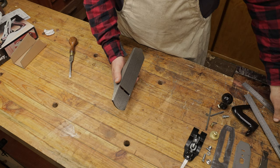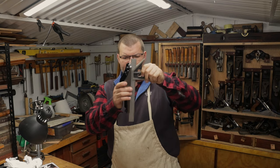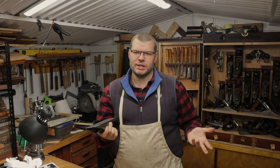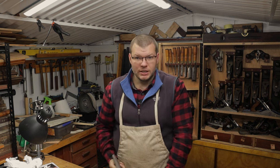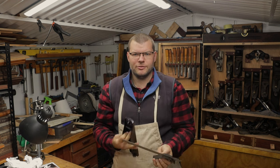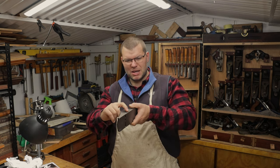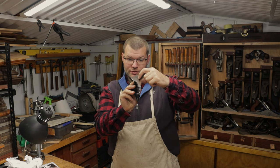I wanted to put a straight edge to the sole to see how flat it is. From what I can see, it's not out too much — at most maybe half a millimeter, which you could easily remove, and I've seen much worse on vintage planes over time. So I don't think flattening this is going to be too bad. Bringing a square up to the sides, they're about standard for what a lot of vintage planes have — not the same squareness as modern premium planes, but relatively square. This one was out by about a quarter of a millimeter at the base. One side has bowed slightly — it's flat at the top and flat at the bottom, but not flat in the middle.